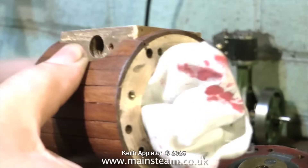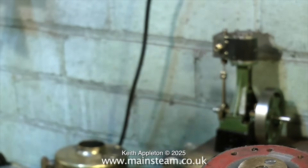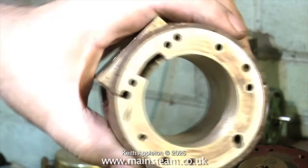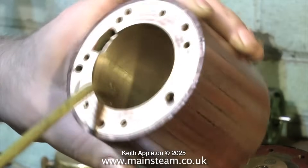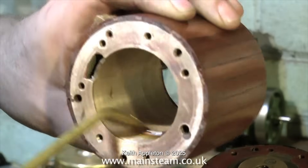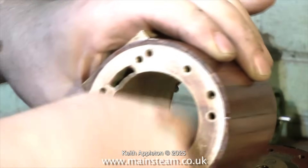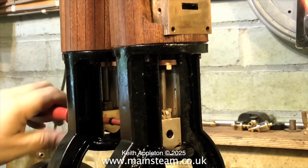Time to see if the cylinder fits on top of the piston. First thing to do is clean out the cylinder because it's also full of dust and grime, and then thoroughly lubricate the metal parts. These cylinders were originally put in a bath of cellulose thinners so as far as grease is concerned they are squeaky clean — not greasy at all. So now some lubrication is required to make sure that you do not prematurely wear out the piston rings.